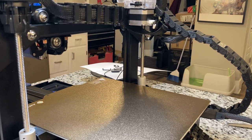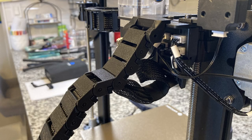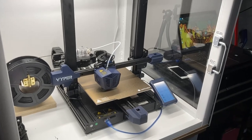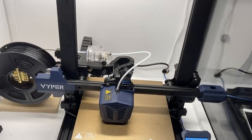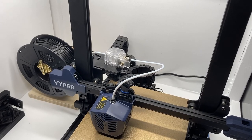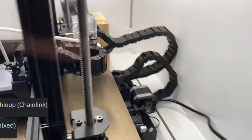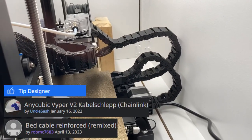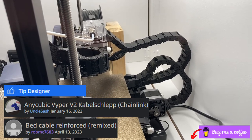Now move all the axes around and see where you need to add or remove chain link covers. And you're done! Back in the enclosure, you can see this is much cleaner than before, and you don't have to worry about the cables ending up on top of the bed. Make sure you re-level your bed and check your retraction after doing this, and run a test print before attempting any larger projects to make sure everything still works. If you end up doing this mod, I'm sure the creators would appreciate a tip, and the same here if you liked this tutorial. Hopefully you found this video quality, and until next time, take care.